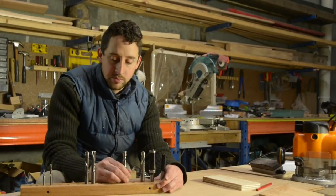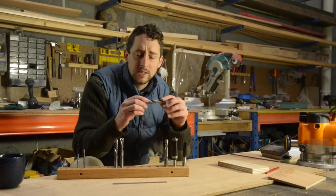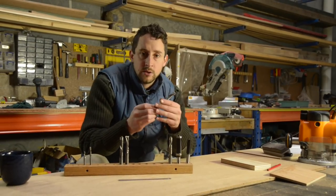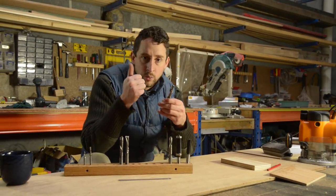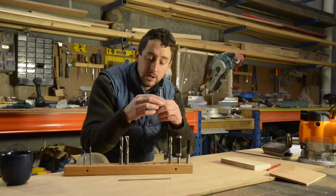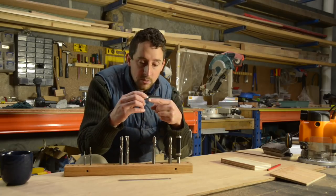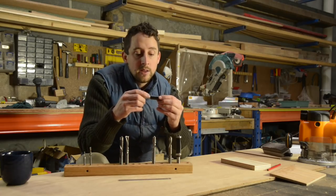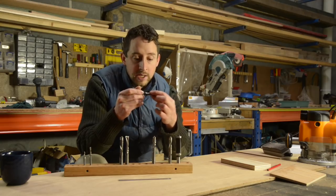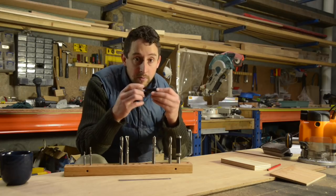The last feature, which applies to both up and down cut bits, is basically the direction of the cut. The effect this has is determining where the chips are going to go and which edge of your cut is going to be really nice and clean. With a straight cut bit, you've just got blades hitting the timber square, so the chips are just going to accumulate in the cut area.